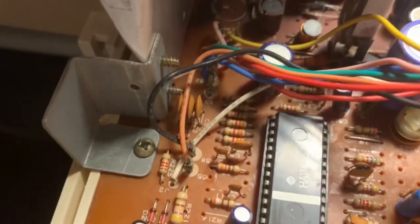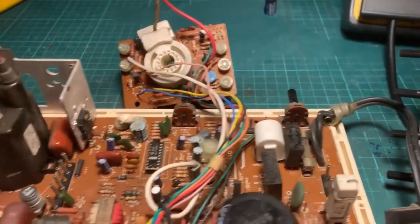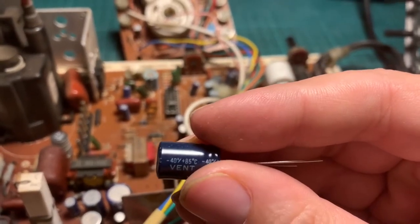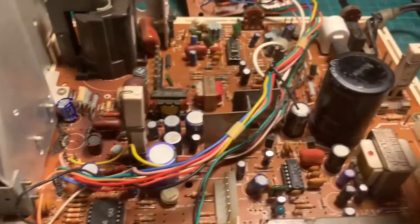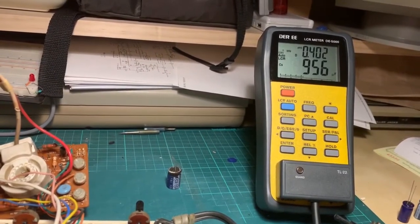So we're going to put these guys in. That's a 470 at 200 volts. And then we had a 1000 microfarad. What did they give me at the store? A 'Forever Cap' — rated 85°C. This is one of those 40% tolerance caps. This is a really crappy cap, actually. Thank you very much, local electronics store — you definitely did not deliver on that one.